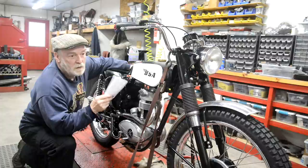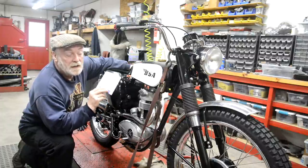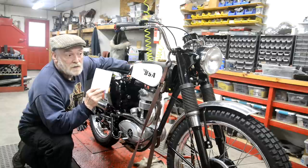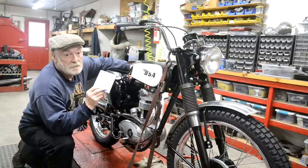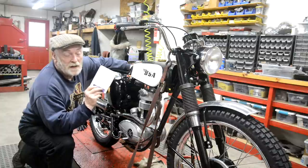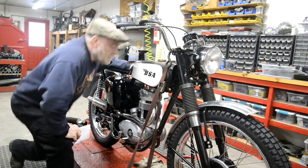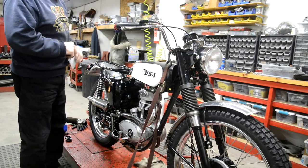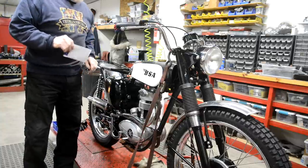If you bought a Can-Am with a Rotax engine, or your motocrosser, it would have electronic ignition with the CDI. The people like SWM and what have you that used Rotax, the same two-stroke engine in their trials bikes, put points on them because you get a much better spark at lower revs.